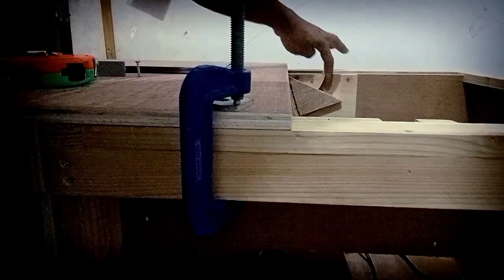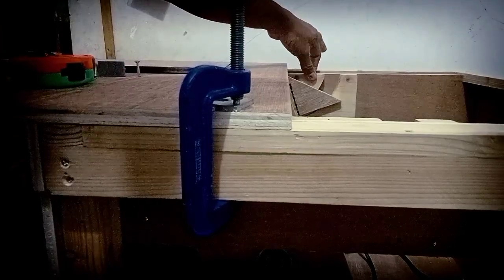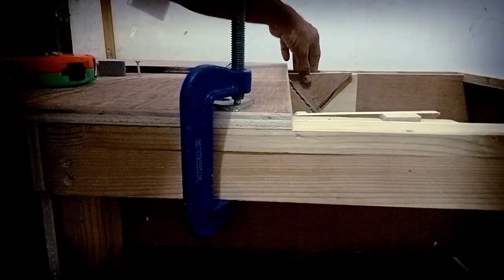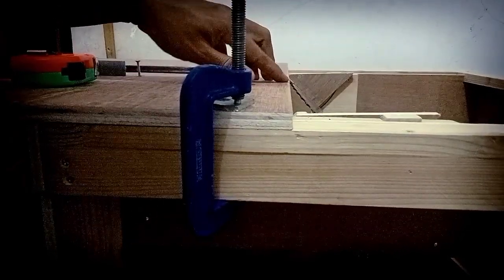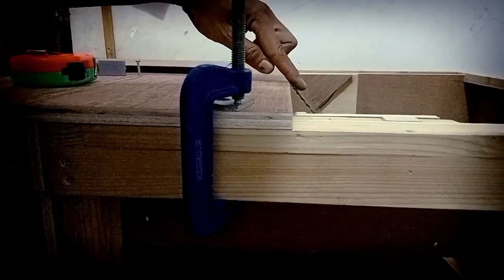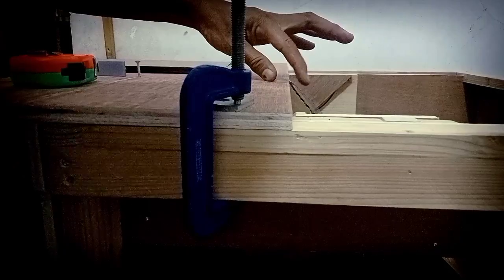The way to fix it: we will raise the support of the 45-degree tilt mechanism, so that when it tilts, the blade will rise with it and not hit the lip of the top table. Conversely, if when tilted the gap is wider — for example if it ends up wider like this — then the approach is the opposite.